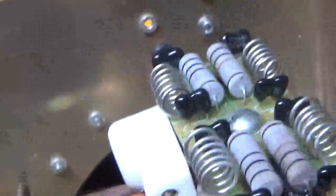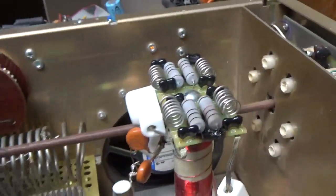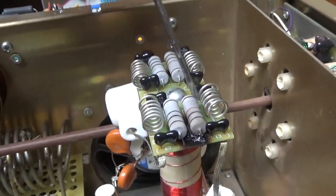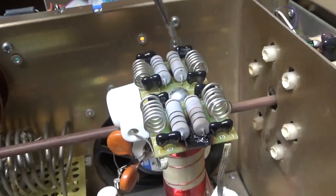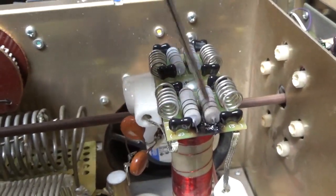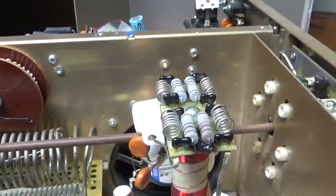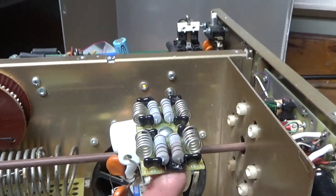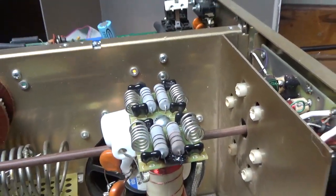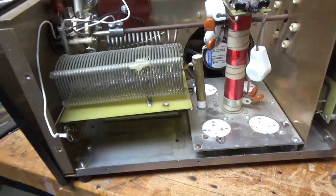I also forgot to point out that the resistor on the parasitic board is damaged. You can see it's all burnt up on the board, on the top side. So I'm going to replace all four resistors. The caps look okay, so I think I can save the board. The traces look okay — it just got really hot. I'm going to take that out and I'll be back.